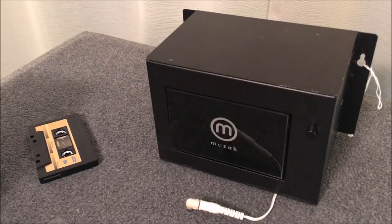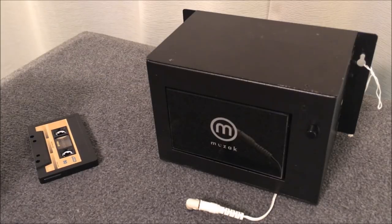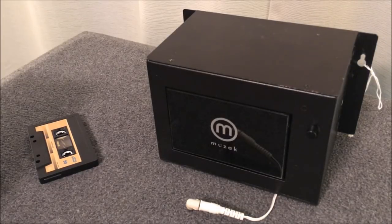The GPX radio had poor sound quality because it was made cheaply, but this Muzak unit outputs poor quality because its audio feed goes into a phone system. It's been designed to be heard over the phone, so they've limited the audio frequency, equalized and compressed it to fit the audio of a telephone system. I can demonstrate that by introducing a speaker.